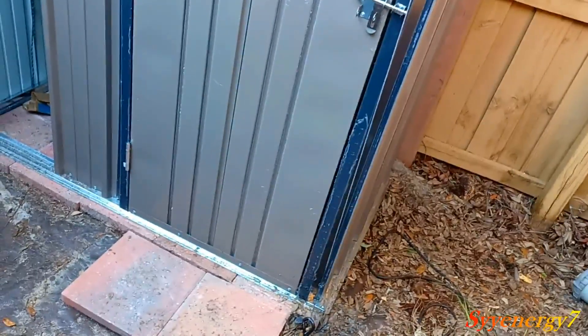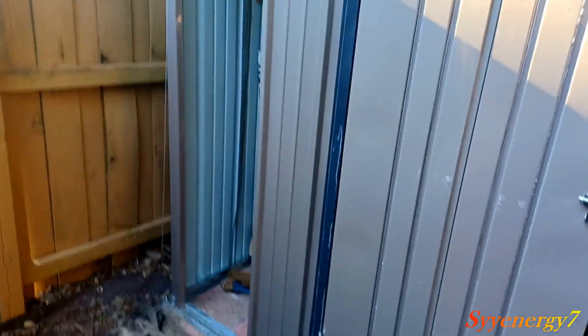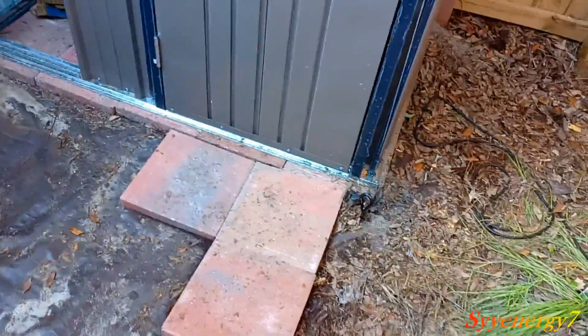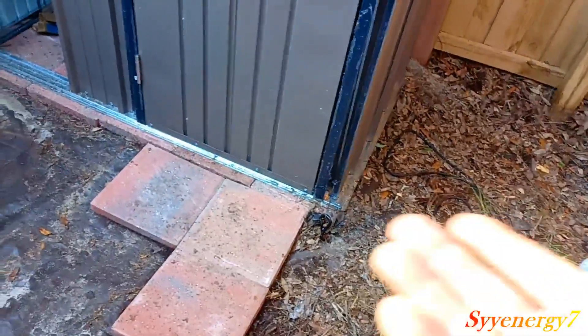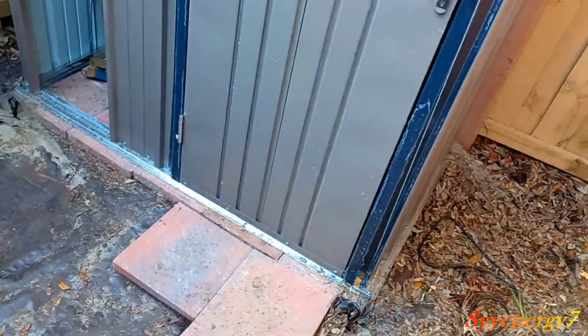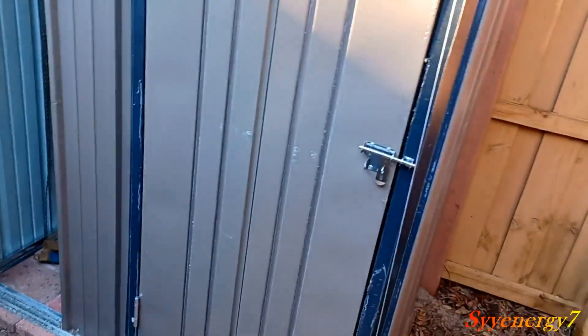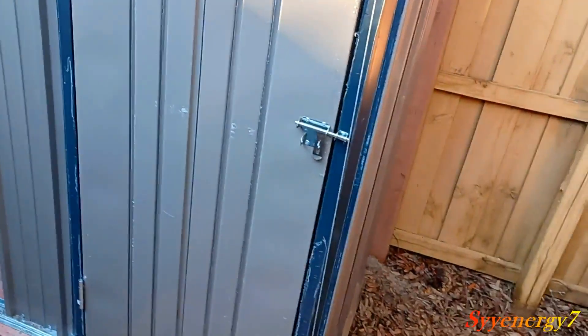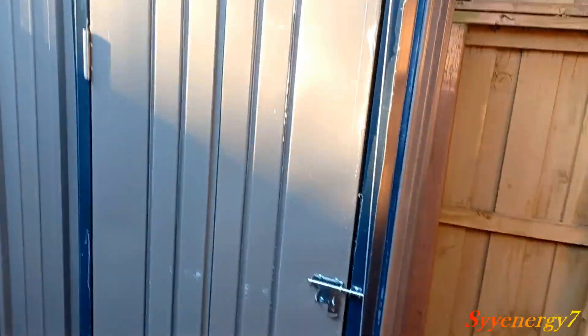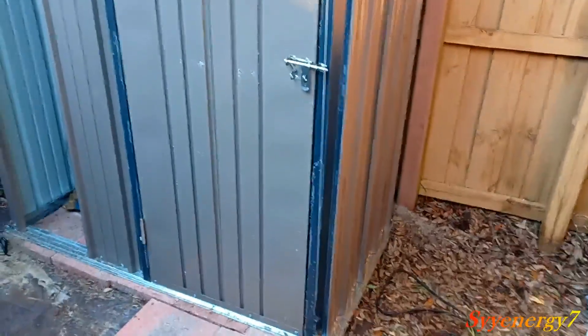You can always be Mr. Overkill, but it's good to go. I've got to wait for this panel to come in, but as it is I could still use it. Well worth the money. Just a couple more tips: get your tie downs; if you want to make it a little higher, do the four by fours on the bottom — pressure treat them — then make a little cement ramp. Put flex seal on the joints on top — even though it's not strictly necessary, if the wind's blowing hard from the side those joints can leak a little. Flex seal on there and they won't leak.